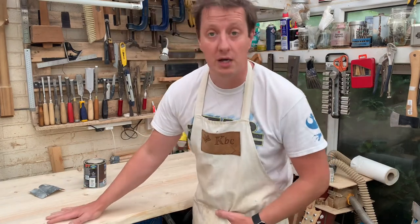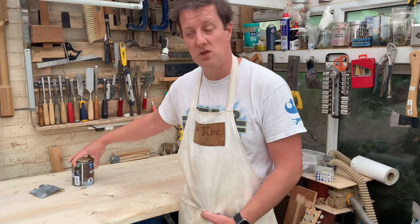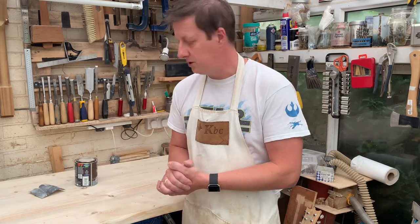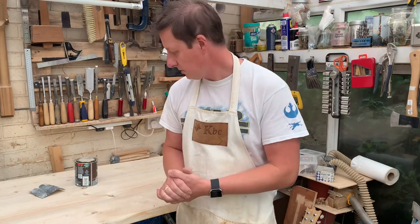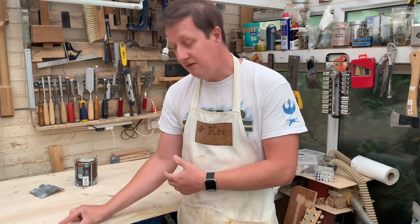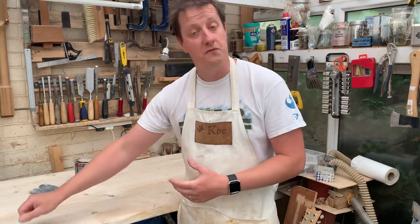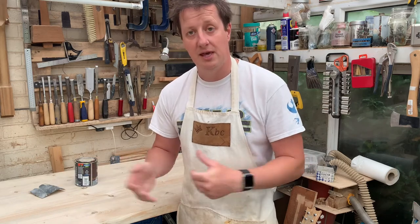The next section is to put the stain on. We don't want to just leave this a monotone colour — we've done the physical part to the board, but now we want to really make it look the part. I'm going to use a natural oak colour, but you can put whatever you want on — walnut, mahogany, whatever you fancy. When we look at real raw boards, they have a different colour heartwood and then a sapwood towards the edge which is usually much lighter in colour. So we're going to need to grade that in as well. What I like to do is leave a couple of inches on the front edge bare, then go in from the stain from that, following the grain lines to make it as natural as possible. Each time we put a second or third coat of stain on, we can just layer that back and grade it in, so it looks like it's been there and that's the growth bringing the colour through over the generations.